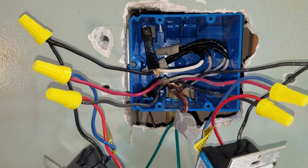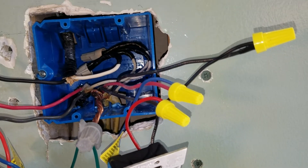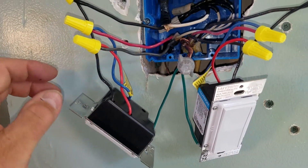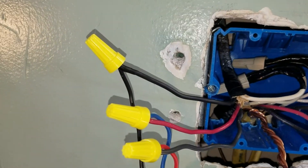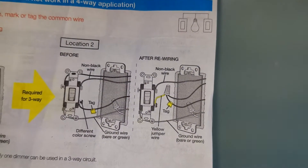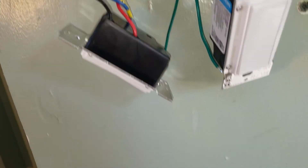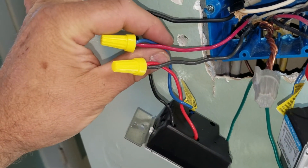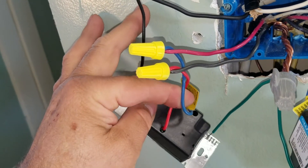The 12-3 traveling wires are going over there and switching and then returning back to here. On these switches the labeling is very confusing. The black wire here is your common — that's the one that connects up to your power. Then it says your non-black wire is going to be a traveler, so your non-black wire is going to be the red, and the red connects up to the blue wire, which is your non-black wire, so that is your traveler.